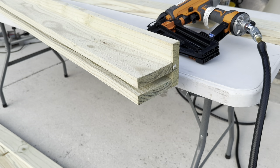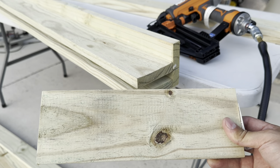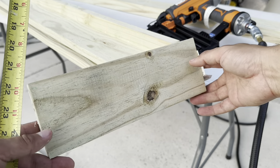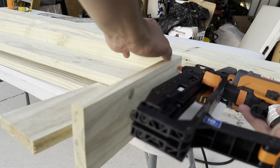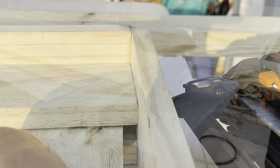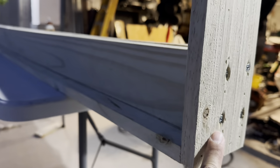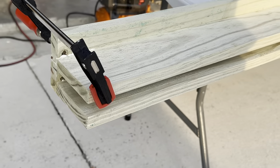There it is for the base. Take that remaining piece we cut off earlier from the one-by-four, pop that and use it in the base right about there. We'll nail that right onto here, and then this will be nailed — or I might even use screws — to the base. After I stapled it on, I did add some long screws in the base to really hold all that weight. Make sure you do get some screws in there to hold the weight. There's the first base.